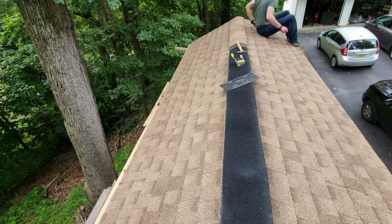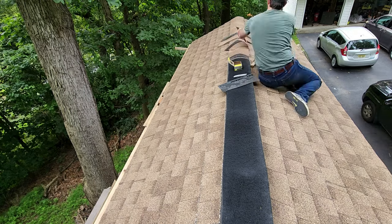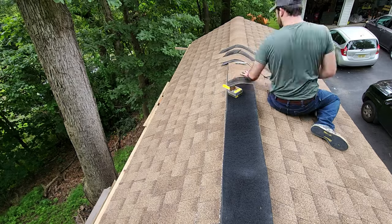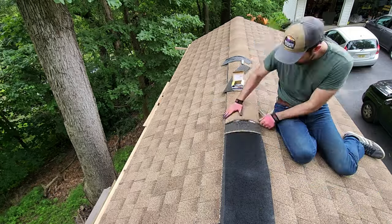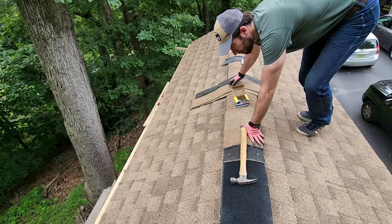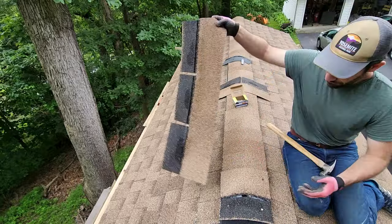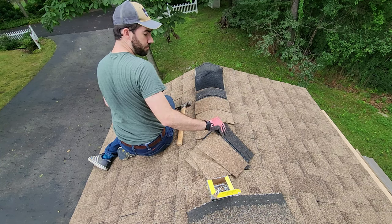Also, this is a less expensive option. This roll happened to be slightly damaged, and because I asked, they gave it to me for almost half price at Home Depot. If I were building a tiny house or a full-sized house, I'd be more inclined to use the rigid plastic vent style. But I don't have any plumbing in this building, so my humidity levels are relatively low, and I don't expect any issues. If you have experience with ridge vents, let me know your thoughts in the comments. They could be helpful for the next person to help them decide what they want to use.